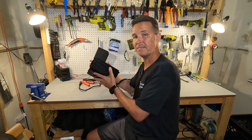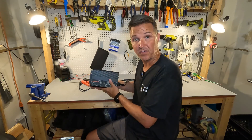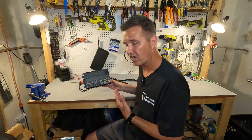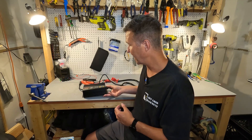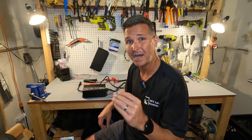After an hour of charging, the bottom felt just like the sides — you can expect the bottom to be around 120 to 130 degrees. Keep that in mind if you're screwing it down. If you're looking for a charger for a 200 amp hour plus bank, this is worth considering. It's all aluminum — not plastic — with beefy battery cables and thick wiring so it's not underrated, and it delivers a consistent 50 amps, tapering only at the very bottom or top of the battery.